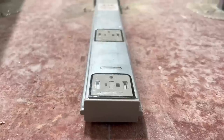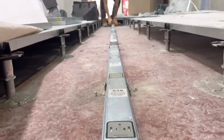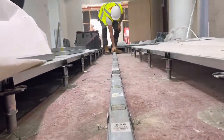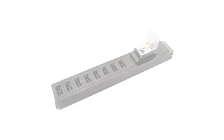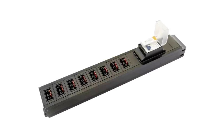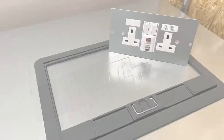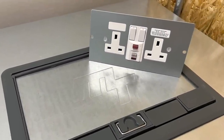When installing this underfloor to desk wiring system there are a number of options for providing RCD protection. You can either install an RCD in the distribution board at the source of the supply circuit, or you can use one of these power modules that uses an RCD to protect additional modules connected to the front. Or finally there's an option to install sockets with built-in RCDs protecting whatever you plug into the front of them.